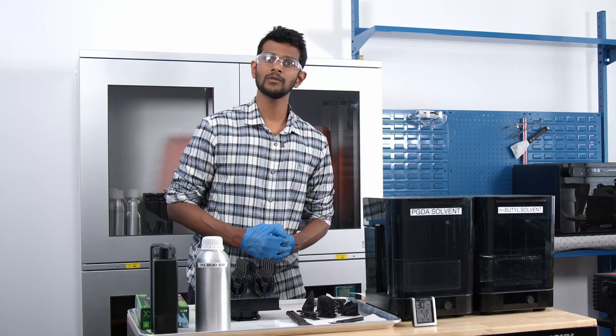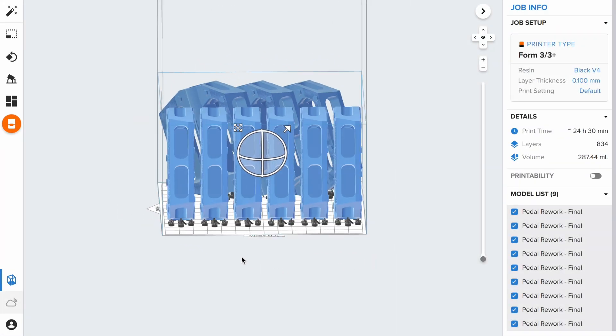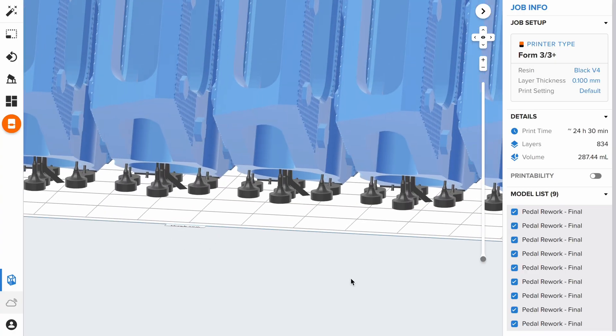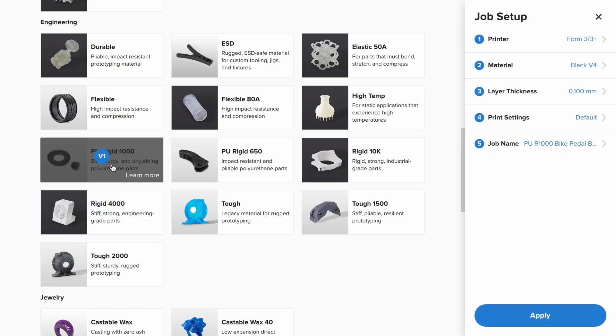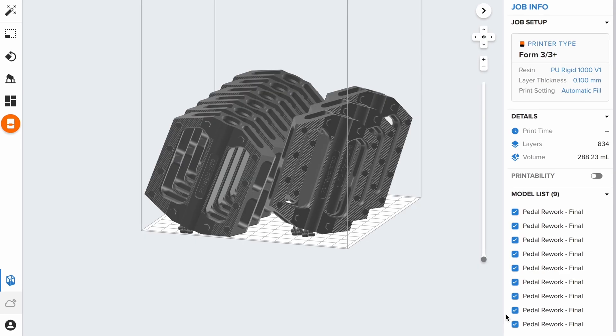Because these resins are sensitive to moisture, we recommend placing your printer in a dry cabinet while printing with them. Once placed inside, make sure that the printer is perfectly level. Open your file in Preform and orient the part according to the software's guidelines. Print all parts and supports to make removal from the build platform easier. Then select your printer, material, layer thickness, and click automatic filling. Now your design is ready to send from Preform to your printer.